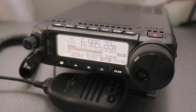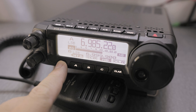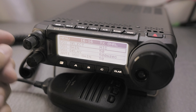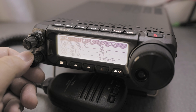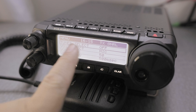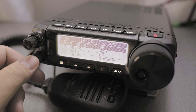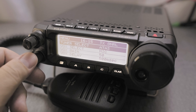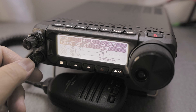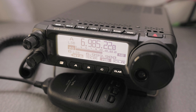What about a tuner? If you have an external tuner, press and hold the F key and go to menu 16, item 15 — Tuner. Right now it's off, but you have options: External, Atlas, or Linear. That's the setting for connecting a tuner.